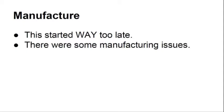The bare boards you have in front of you take around 40 minutes a panel to bare board test, and these boards go through up on a panel, so there's about 500 panels to get through. So it's a relatively slow process. By the time we had a plan, we knew we wanted 5 days to assemble these, but we could push that down to 48 hours.